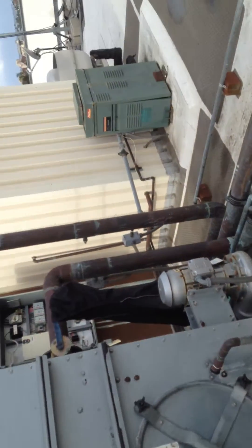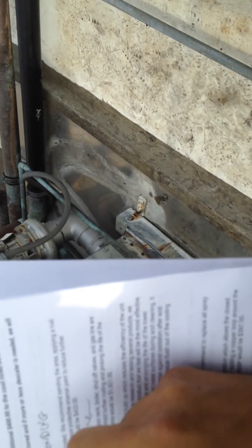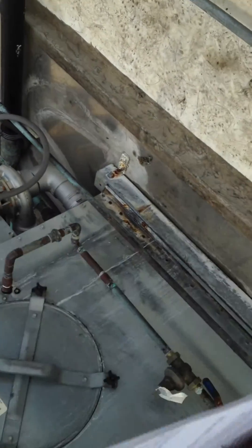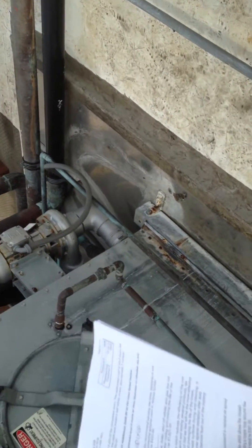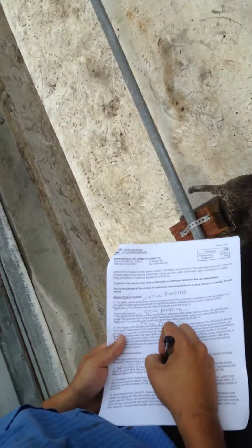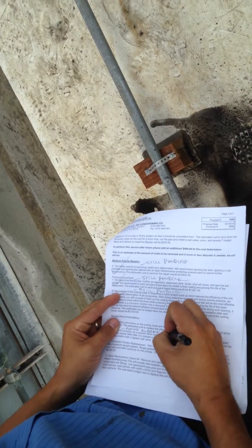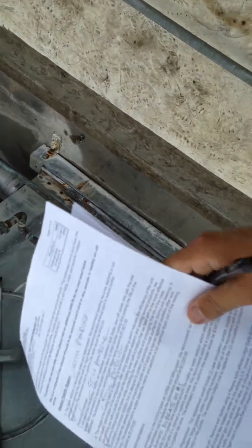The interior of the tower is beginning to have scaled buildup. Still pending. Let's look at these spray eliminators — those should be at the top of the tower. When they say spray eliminator, that's basically self-explanatory — it eliminates the spray. I put this one on here as a duplicate, no bypass. It's a duplicate, needs to be removed.